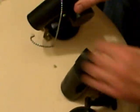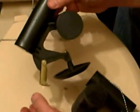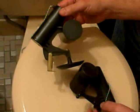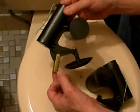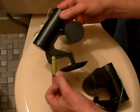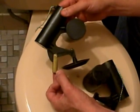So again, you need to know the style before you go into the store. To show you an example of just one of the other styles — this is, for an American Standard, very similar. But rather than attaching to that plastic bracket inside the tank, this is designed so you use two brass screws, unscrew the whole assembly, and then you'd have to change it like this.